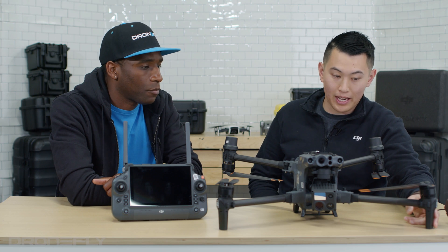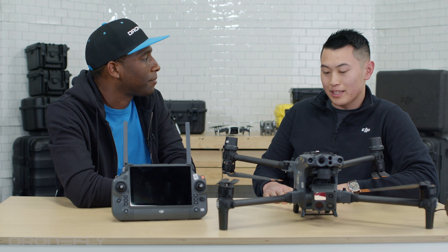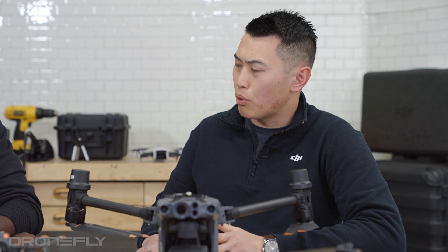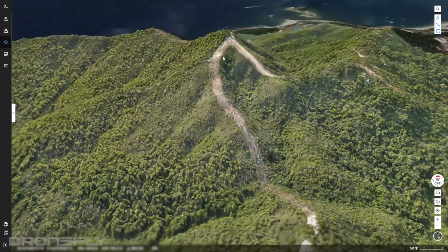You have your propellers, you have antennas right here, and then you have your RTK beacons. What is RTK? RTK is real-time kinematic. It basically corrects any errors for any satellites or anything like that. It's really important in mapping and surveying where every centimeter actually counts — if your map is wrong by a foot, it's a big deal.